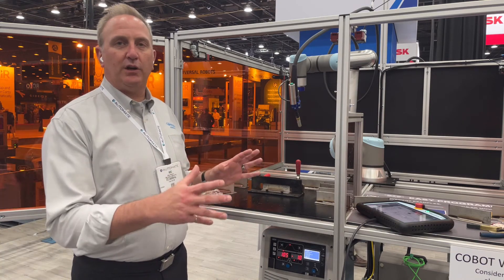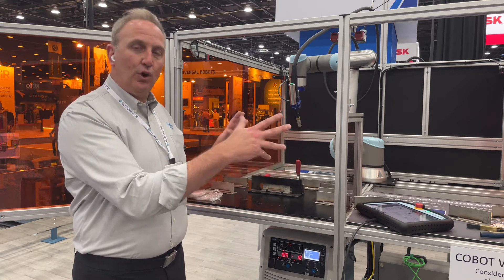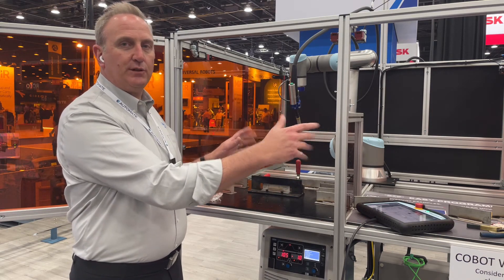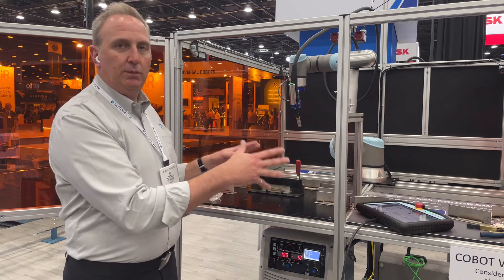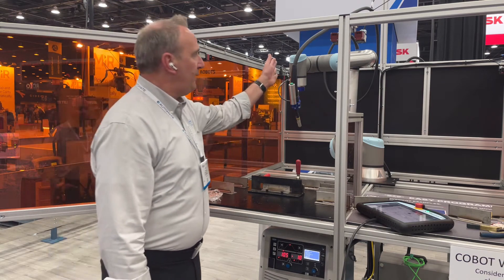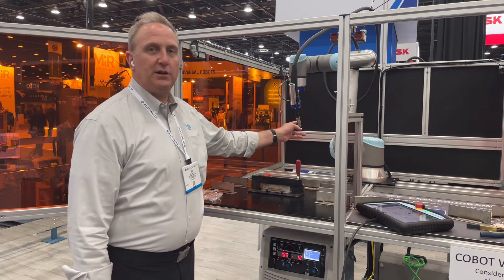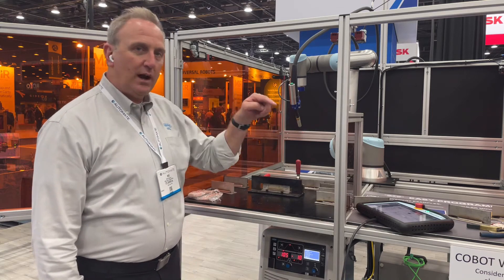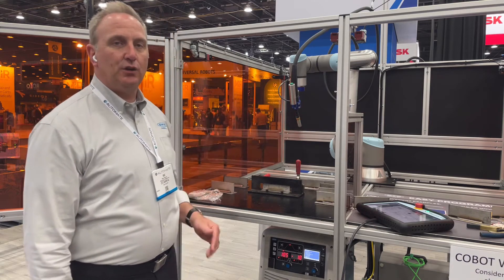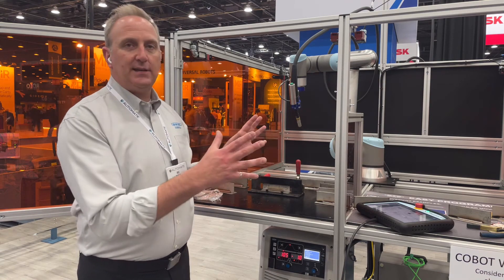Why do I make that distinction about production? Because we've applied the safety necessary to satisfy OSHA requirements. That means we put in barriers here so you're protected from arc flash, but also pinch point protection. A Cobot by itself may be force limited, but once you put a tool on the end of it, your safety spec is only as good as the tool. Every weld gun has wire sticking out the end of it, so you really have a dangerous situation — something that could hurt you in a permanent way. We have to take that safety into account.